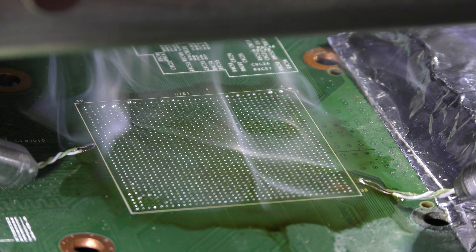So I'm going to demonstrate what hot and cold spot actually means. When it reaches the right temperature for the chip to come off and you're trying to push it but it's not moving, that's because there's still a cold spot on that side. I'm going to use this special tool to remove it. And this is what happens when you don't have good wick — you can see there's already a cold spot on this side of the board.